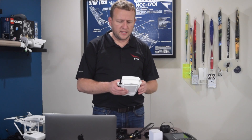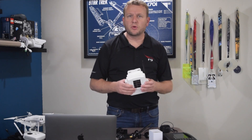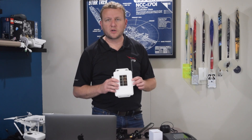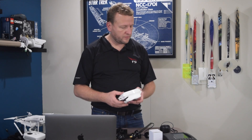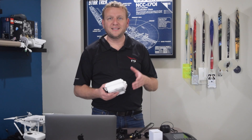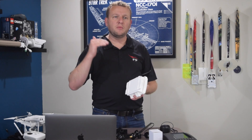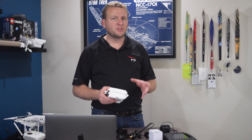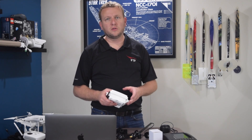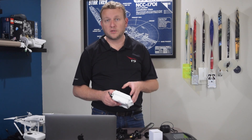The other piece is this additional remote sensor module. This is something that I purchased a few years back and never got around to installing on my original system. For meteorological installations, the wind sensor should be placed at least 33 feet above the ground and seven feet above any building rooftops or trees that may be around. I've got some options here, and that's something we're going to look at.